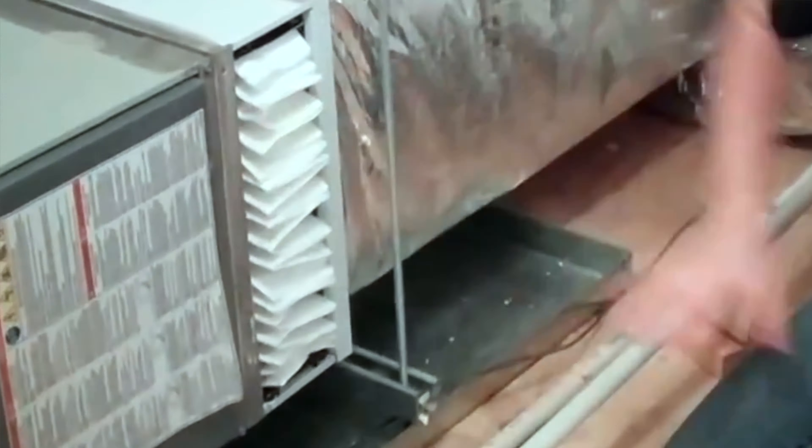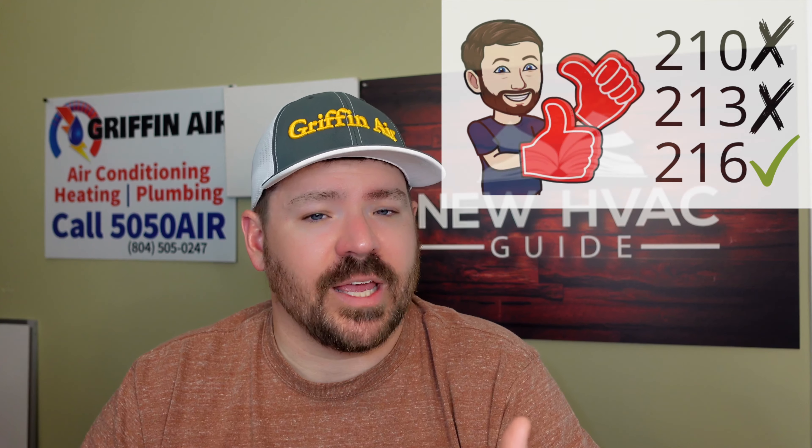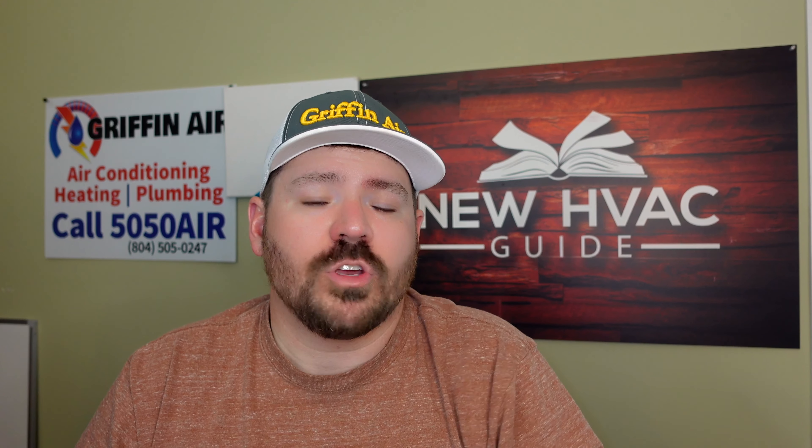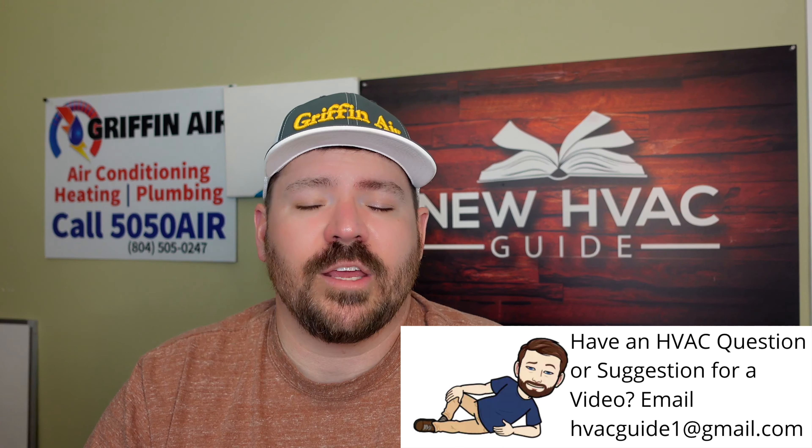The reason for this video is that Aprilaire has recently made it way easier. You don't have to replace the entire housing or get some fancy filter. All you have to do is when you go to replace the media in your filter. So if you have an Aprilaire 1210, 1620, 2210, 2216, 3210, or 4200 — which are all pretty common models — instead of replacing the media with either a 210 or 213, you can now replace it with a 216. I'm going to put a link down in the description where you can purchase your own 216 filter media, and you're going to get that Merv 16. It's going to filter the air even better, and you did not have to do any crazy configurations with ductwork or getting your heating and air professional in there. You just order the media, swap it out, and now you are filtering the air way better, including some viruses.